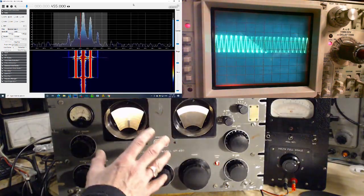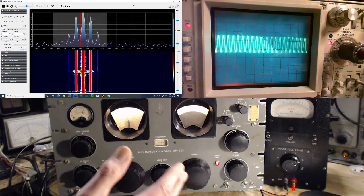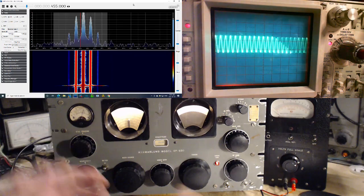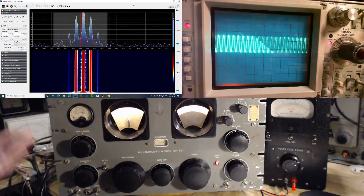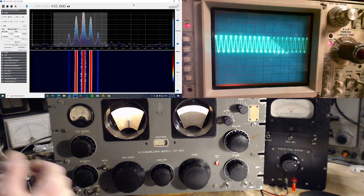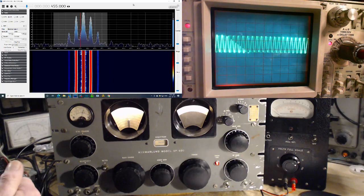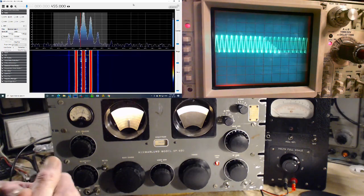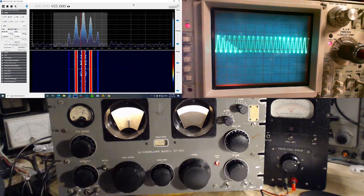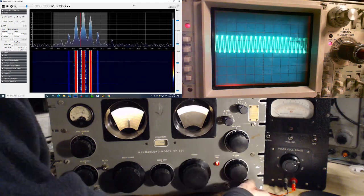So the other thing about this radio is it can handle a whopper of a variation of signals, and you've seen it here. It's gone all the way from almost 100,000 down to a couple of microvolts, and the output signal remains pretty stable. It's really, really good. So we're trying to get some audio distortion happening here. We didn't succeed. I think I could force it by taking manual control of the RF gain, and we'll watch some of what happens. Turn this down. Okay.